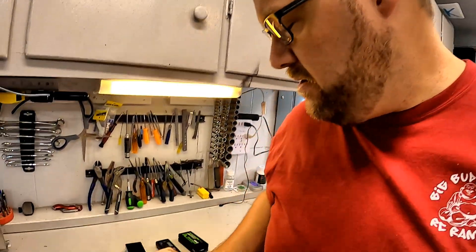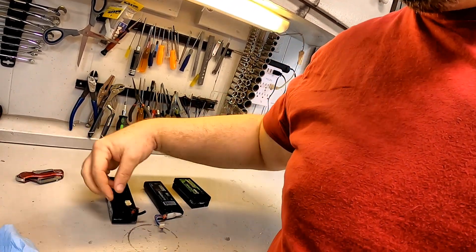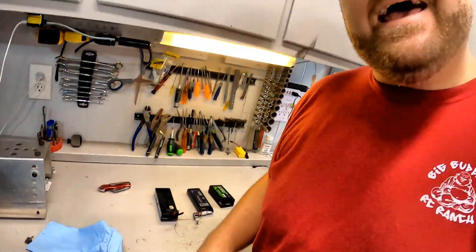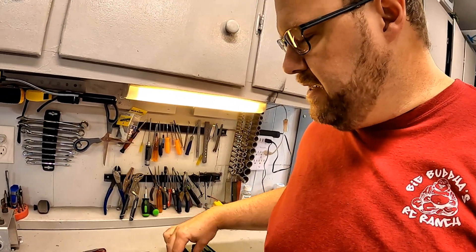To be clear, according to conventional wisdom you are now done - these batteries were soaked in the salt bath, they should be dead, and you should be able to recycle them at a local recycler or dump them straight in the trash. That's the wisdom we have right now. I am going to use a knife and other tools to cut them apart and look at the cells inside. I do not suggest you do that - you have to be very careful. You don't want to puncture the cell in case there is any energy left, as you may cause a fire. If you proceed, you're doing this at your own risk.